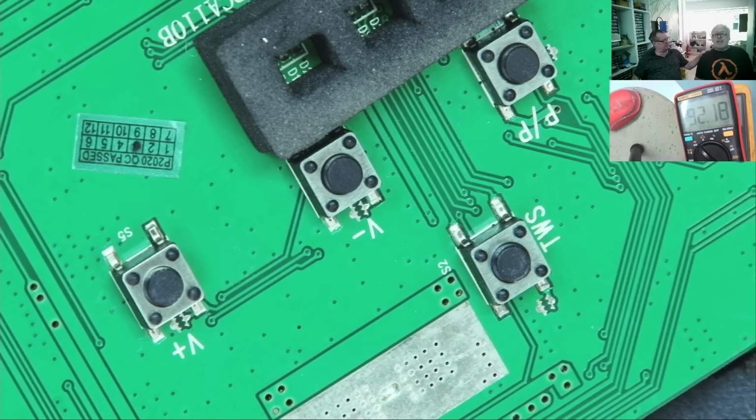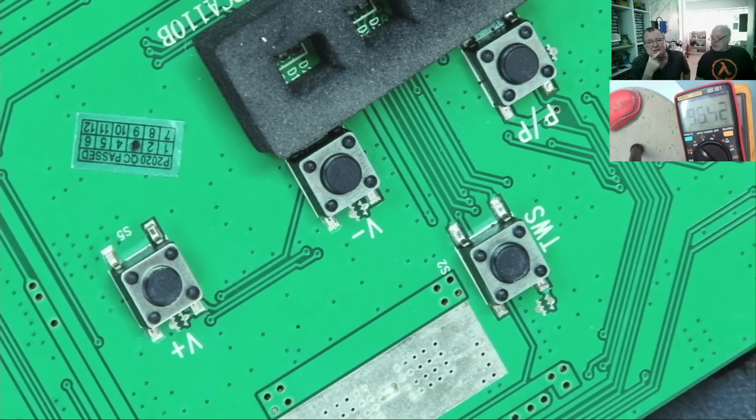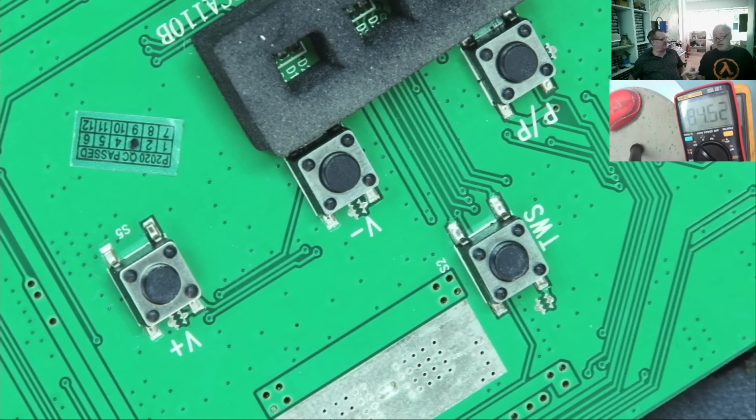Yeah. You fixed it. No, it was between us. And to be honest, no, really, you guys fixed it. Because one of you suggested that I might have a short from the centre pad. Yeah, I read that. But nobody suggested that I might not have a connection to the centre pad. No ground on the charge chip.